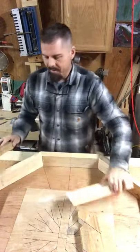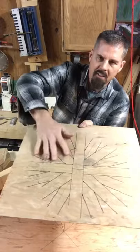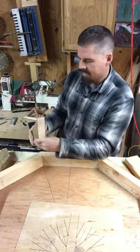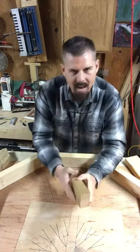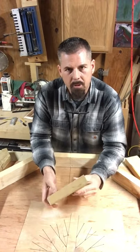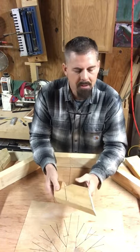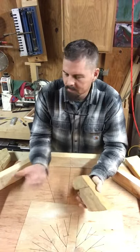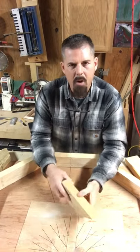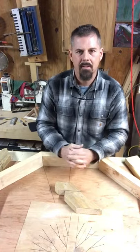That's important. What we have here are the deductions and setbacks for the top of the rafters and getting the proper height above plate lines down at the bottom. That's the battle — that is the battle of stacking a hip roof correctly. It's not getting the length; you can get the lengths from a book, buy a rafter book, figure out your span, look under the tables, and it'll tell you the length. It's how all of the wood goes together properly — what to remove, what to leave.